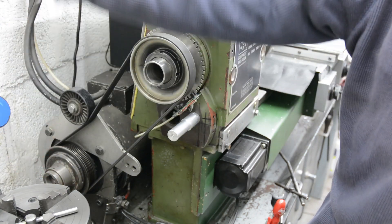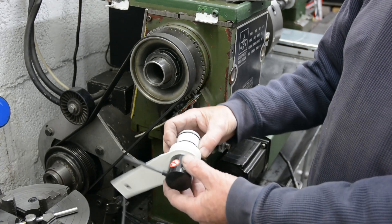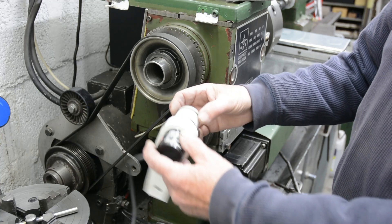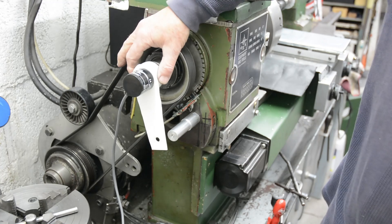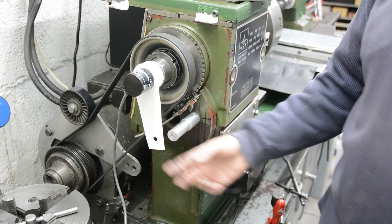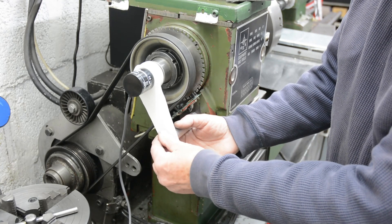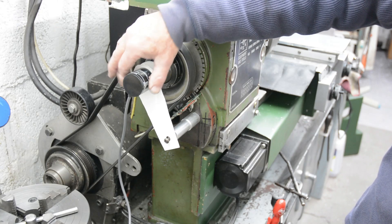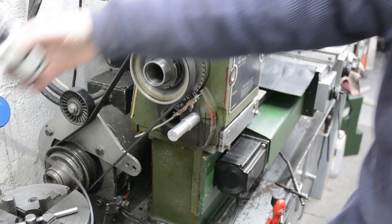I mentioned that one of the important things was measuring the speed with this rotary encoder. That's fitted onto a little plug here which rotates to drive it, and with the O-rings that's just a nice fit inside the spindle and a secure drive. To stop the outer case rotating, I've got this little plastic torque arm here which I can bolt up to this standoff, and that stops the outer part from rotating, giving me an accurate measure of the position of the spindle.